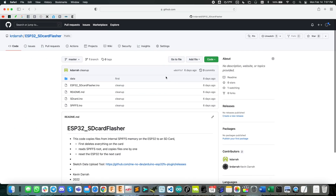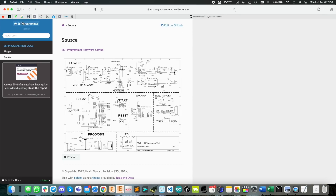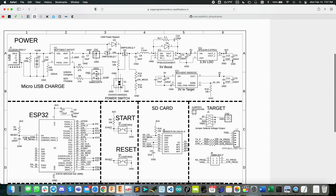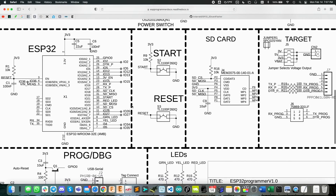I've got the code up on GitHub so you can pull that down — it runs right on an ESP32. For the connections from the micro SD card to the ESP32, you can go to the documentation for the ESP programmer board and find the schematic there. If you're using your own ESP32 board with an SD card holder or a board with it built in, you can see the connections there and you may need to make changes, which I'll show you in the code.